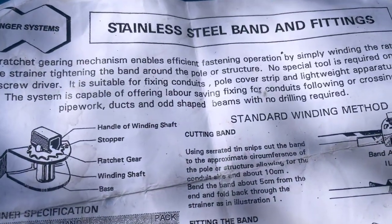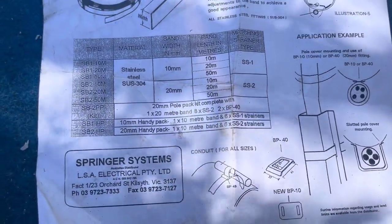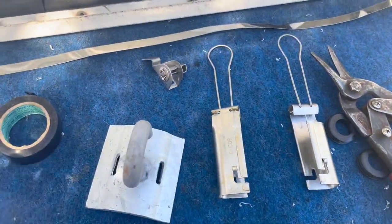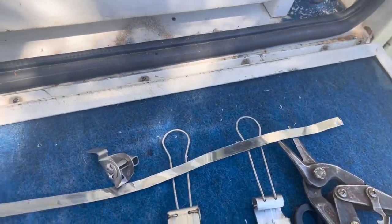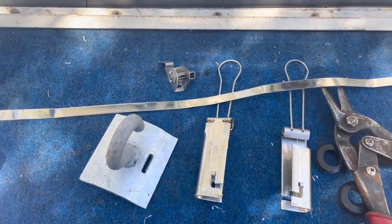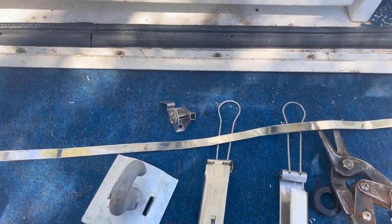I found the old instructions on how to fit these. I'll show you how it's done — this is the instruction sheet I've had sitting in the truck for ages. So I went over to the pole and chopped off the length that I need, with a little bit of slack I'll trim off with the tin snips once that's done. I'll assemble this first and then put the hook on the pole — it has to be 600mm below the power line, so I'll go up the pole and make a little mark.